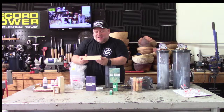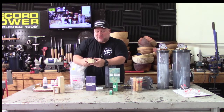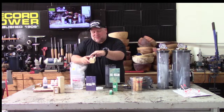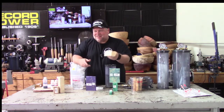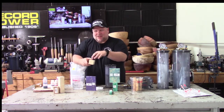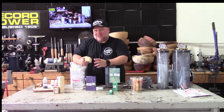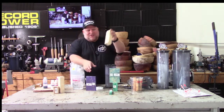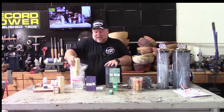Some ways I've done it in the past is when I have a really good set of pieces that I know will travel through the grain real well, I'll put them in a tray and I'll kind of drip resin on them and let them soak through. And you can usually see where they drip on the top and then they come out the bottom. So you know it went through. So that's good. And you can just do that, and then you can cure it and sand it. And then you're not getting a lot, but you're getting some color. And probably some of the best blanks I've made were that way, but they're just so terribly time consuming. It's horrible. And then you can do another color, cure it, sand it, do another color. And then at the end, you can throw it in clear or whatever to fill in. So there's a lot of ways you can do that.